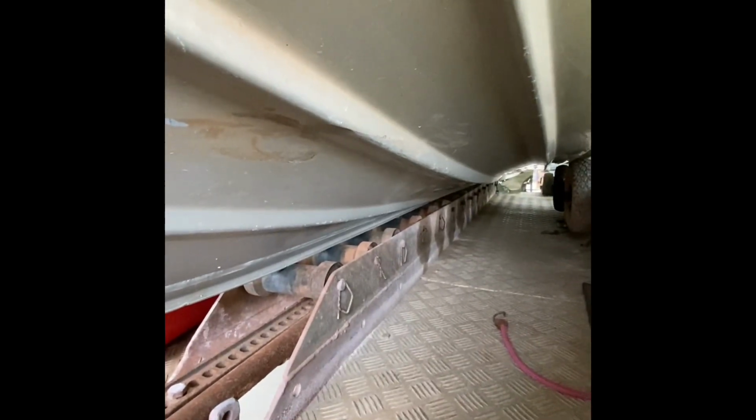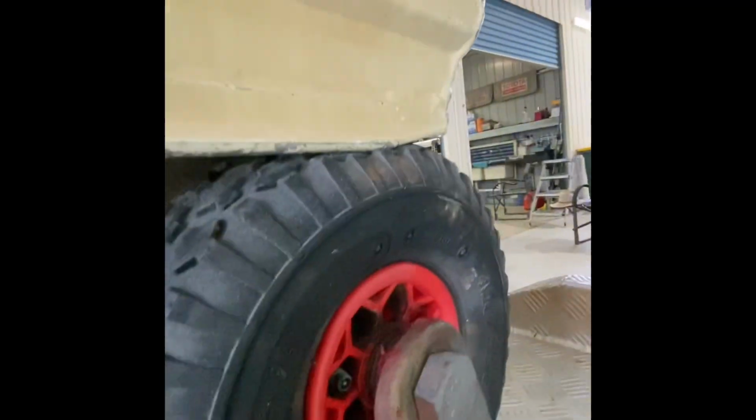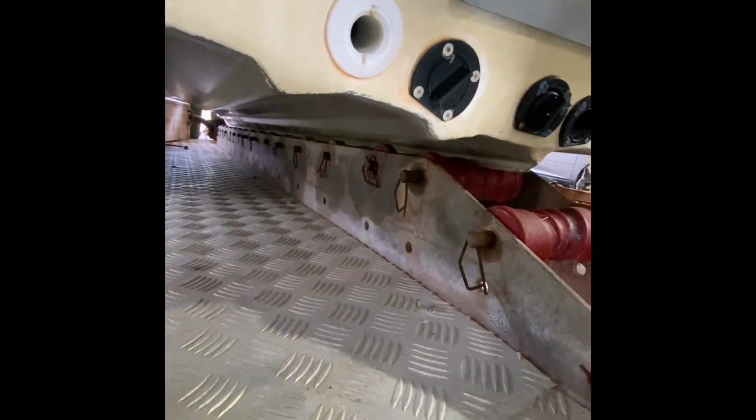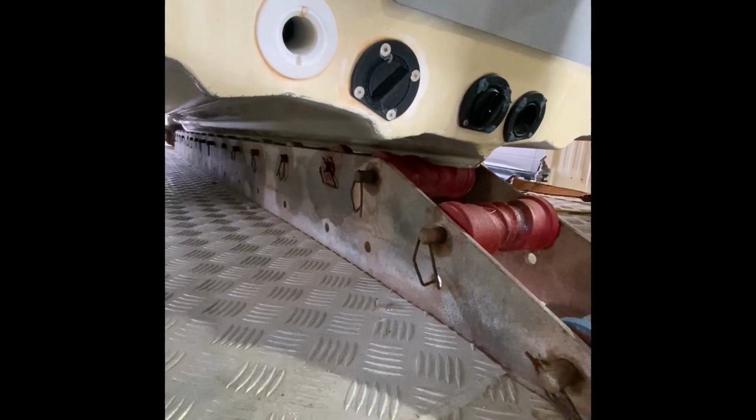Now what I'm going to show you here is I think I run 18 rubber rollers. I use rubber, the reason being they're only that far apart, is it has full support under the hull when the boat's loaded up. And I run pneumatic tyres underneath there, like that. The hull's on the edge of the support. Fully down along there. With the rubber and this boat, you do not need to push it off. It just goes under the winch and it winches off itself.